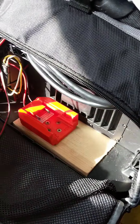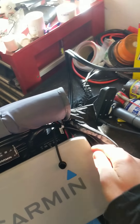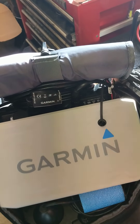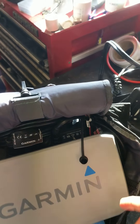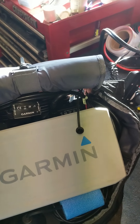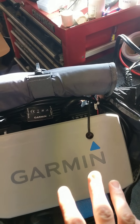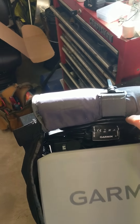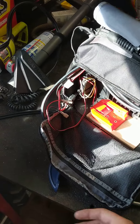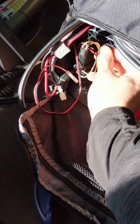To break it all down, if for some reason you don't buy this bag - say you want to go with a clam bag, a kitty litter box, or some other crazy idea - this is all that matters in the whole scheme of things. The power from the LiveScope, the power from the actual power wire that comes here - they give you a longer one with a built-in fuse and all that stuff. Just use all the stuff they give you. It's going to have four wires in it: two smaller ones and a red and a black. Only use the red and the black. Don't use the other ones. The red and the black and then the red and the black from your LiveScope box get tied together, and then really all you need to do is tie it to one of these plugs, and then you can easily attach it to this.